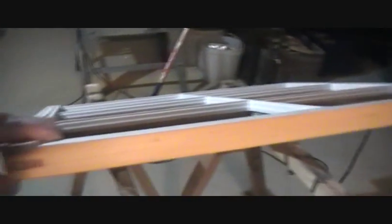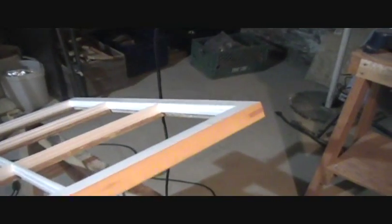Okay, next updates. I have sanded the ends of the wood where I cut it with the table saw, wetted it a couple times and sanded it again, so it's pretty smooth now. Down where there was a gap in here, I've filled with spackle a couple times. I just did it one more time, and now I have to do some sanding once that dries, and that'll be a few minutes more.